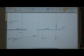So you say, I have a worry about the middle one. Now it's a decision. What are you going to do? And maybe you decide you'll take your chances. Maybe you'll decide, no, we can't do it that way. We'll have to open one breaker, close the other, and make a transition with it. For a moment, you'll have no power, and you'll have to tell the people, I'm sorry, that's the way it is, and you'll have to manage with it, because we can't risk blowing up the equipment.